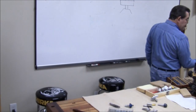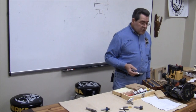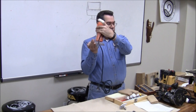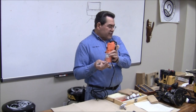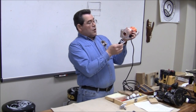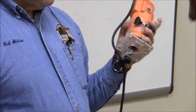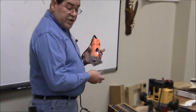A lot of different routers will come with some sort of a guide fence. Even this little $20 piece of junk has one. Essentially this fence mounts to the bottom of the router so that when you're doing handheld work such as trimming the edge of a countertop, it will guide the router. If you have to do curved surfaces, this won't work — so what they offer you is a bearing which also mounts to the side of the router. You position this bearing so that the surface of the bearing lines up with the surface of your cutter. It will follow a curved surface and do it well without a bearing on the bit, for guiding a non-bearing bit, which is a whole lot cheaper than bearing-guided bits.